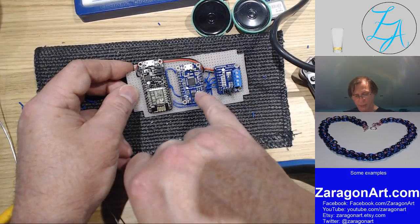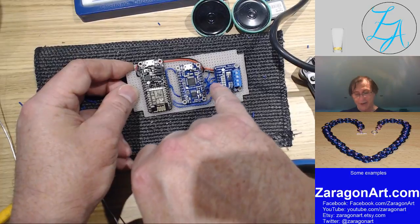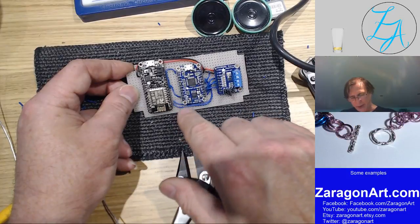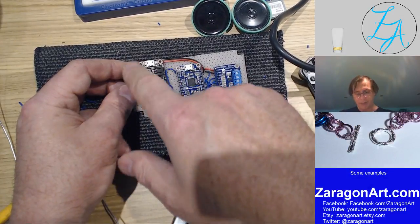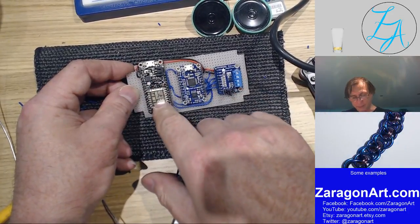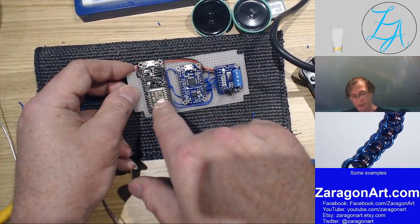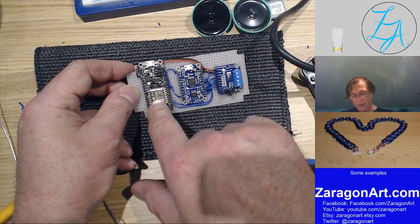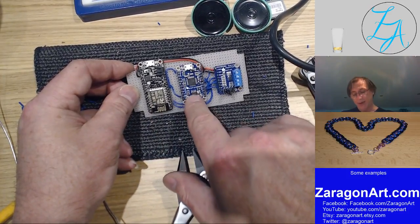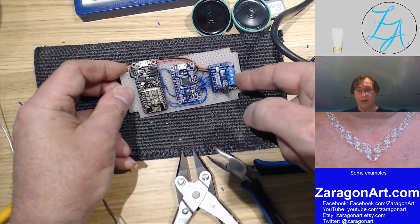For example, if I look at these, they're often labeled the same thing. I've got an R and an R over here, and those two are wired together. What I've got here is the Wi-Fi unit, which talks to my Wi-Fi in the house. When it picks up the signal from the controller over Wi-Fi, it tells this to play track one of its memory, and this then plays track one. This is a speaker amplifier, and I have speakers plugged in at the ends here.